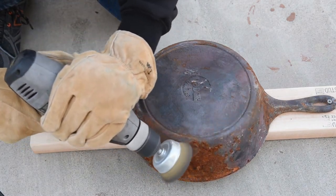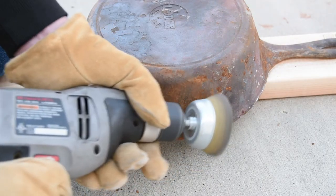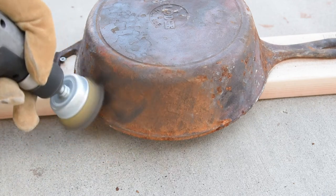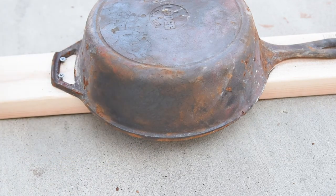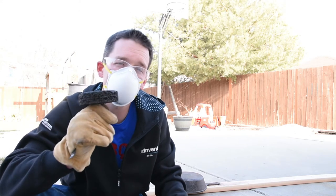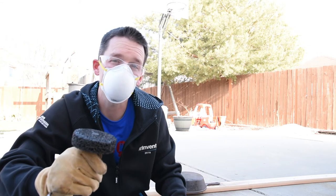By quick work, I mean this actually took quite a bit of time, but it was a lot easier than doing it by hand. I've got some of these items in the description below in case you want to find them, but you can also get them at your local hardware store. The cast iron pan is starting to look really good — we've gotten most of the surface rust off, but the surface is still pretty uneven. At this point, I'm going to take it a little bit farther with a strip disc, to take the top layer of metal off so I can get it smooth enough to cook on again.